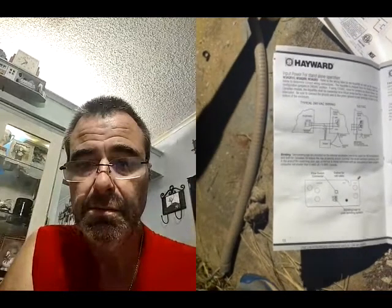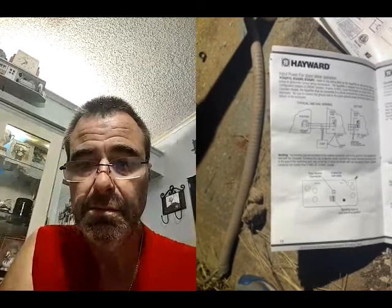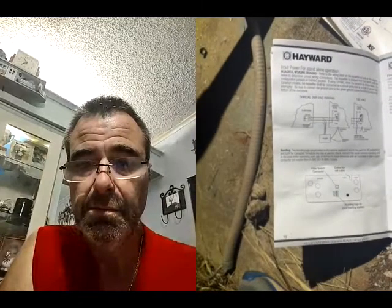Here's what I would do. I would come out of your sub panel and go into the line side on your Intermatic, your L1 and L2 on the line side. Then on your load side, take your wire to your pump, and take the wire on the load side and go to your Hayward. That way, when your timer's set on and off, both of them will come on and both of them will go off. You're set, and you're done. Yep, that would be perfect.